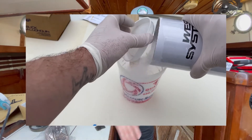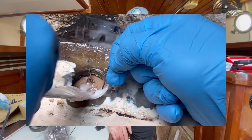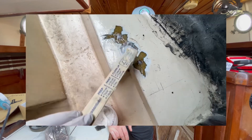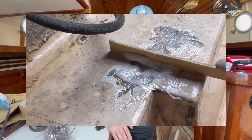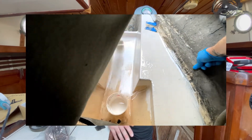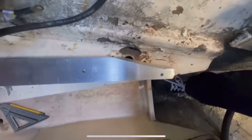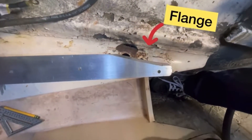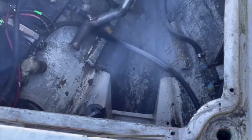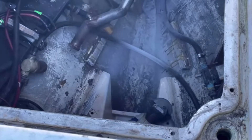To conclude this series, we covered the little steps of removing the old bolts, the old engine, the old residue, glassing over the former bolt holes and making sure that's flush, and making sure the bay is prepped and painted. The aft mounts could not go far enough, so we had to cut away the upper sides of the pan mounting flange to slide those plates outboard for proper spacing. A four-inch grinder with a metal cutting blade worked well for that.